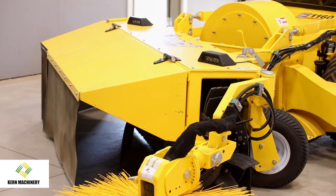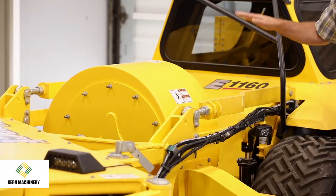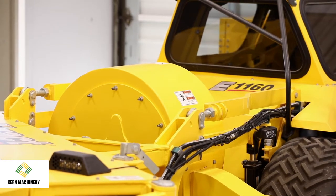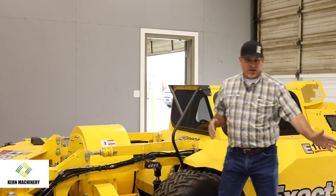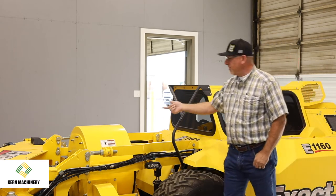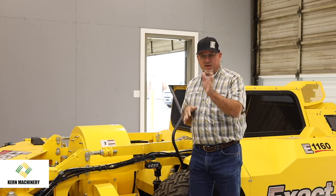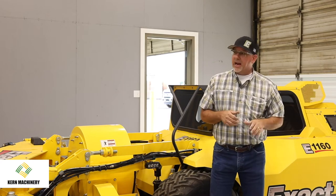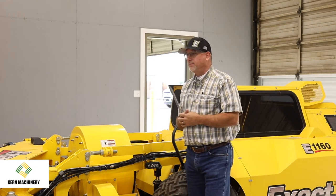We also put the blower up here in the front. And it's purposely done that way so that the driver is able to see his blowing job and see the finished work of his blower, okay? Because he's blowing the distance in between the trees that you can't get with your sweeper, and he's seeing what he's doing. He can actually adjust the angle and the RPMs of the impeller, which is the amount of velocity of air coming out, right from inside the cab. So he's seeing that, looking out sideways or front or sideways from his window, versus the competitors where you have to look back through that dirty airstream. So a lot more difficult to see what you're doing and get your machine adjusted.